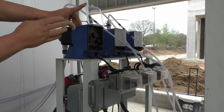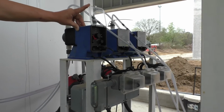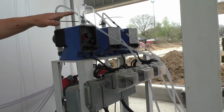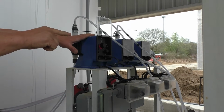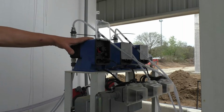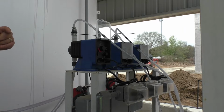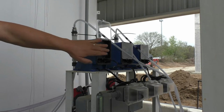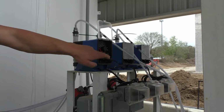So that's the speed. In my experience with these pumps, they're small and you've got a long feed line. For me personally, I would run this pump with the stroke all the way up. You want the longest stroke possible, and then adjust the speed of the pump, which you can do from SCADA. You'll slow it down and speed it up, and the volume coming out goes up with the speed. Let the stroke length stay the same, because if you shorten that stroke length, it's just barely moving, and you've got over 250 feet of line to get it through. So just leave that stroke all the way up. But just so you know, that's stroke control, and that's your speed.